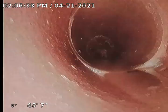Alright, we've got that spot located right about the sidewalk. So, started at 69, we're about 45, so right about 25 feet, 24 feet of shared 6-inch sewer line before we come back into the personal line for 3914. So coming back now into 3914's personal line.